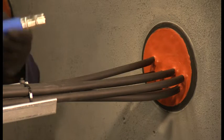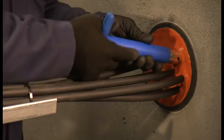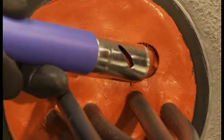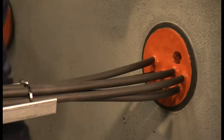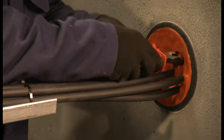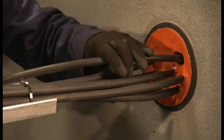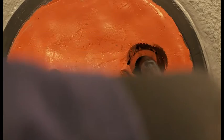Adding new cables is a simple process. The recommended coring tool is used to remove a section of the sealant layer to locate an empty sleeve. Please take care not to damage existing cables. Pliers can also be used to remove the unwanted sealant. A hole slightly larger than the new cable should be made. Insert the new cable through the empty filler sleeve. In this case, an additional 12mm cable is being added to the penetration. However, we can also easily add a larger cable to the penetration.